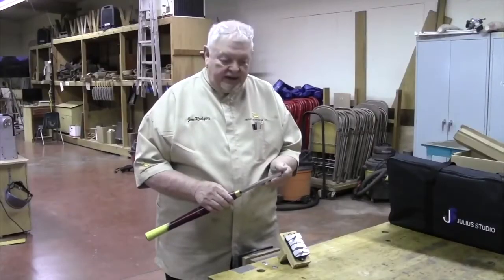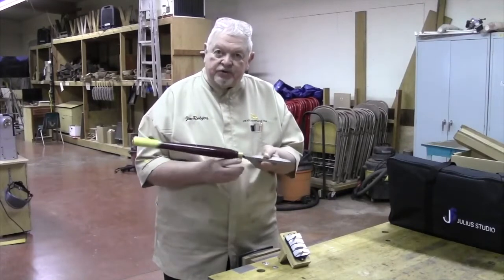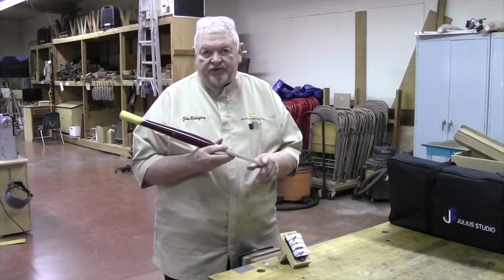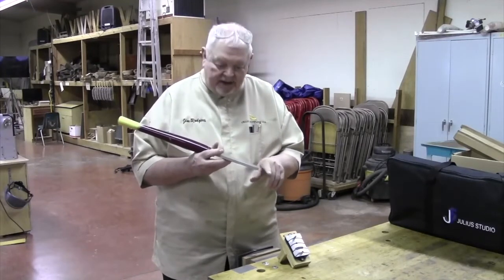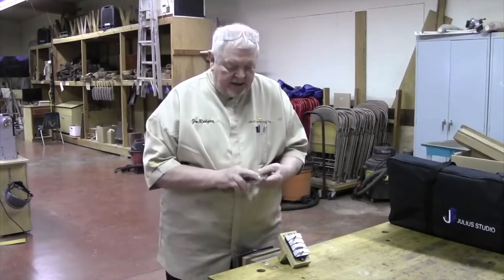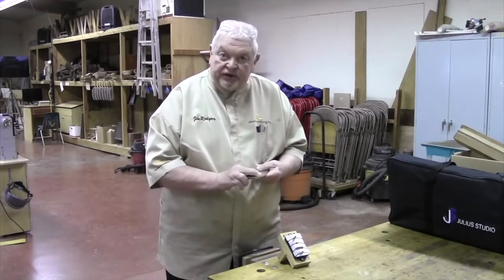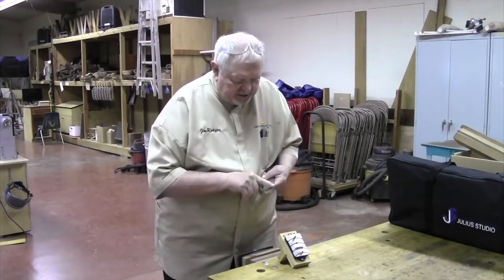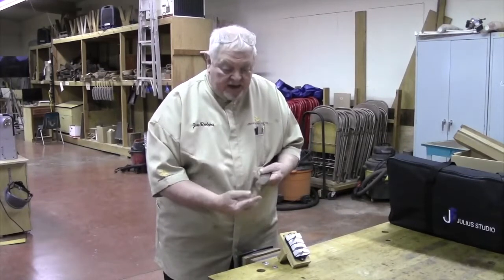One of the things we can do is to actually raise the burr on the edge of the scraper. If I'm dealing with softer woods, that burr is my cutting element. If it's harder woods, generally the burr breaks off in the first cut and we're really using the edge. But for me to get this sharp and a burr raised, the very first thing I'm going to do is take my card to the face of this,